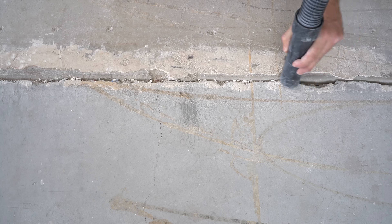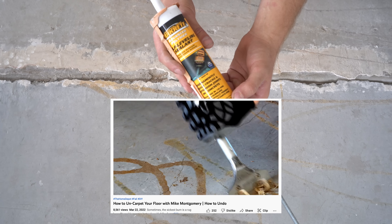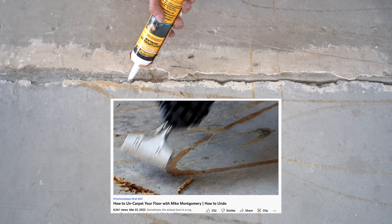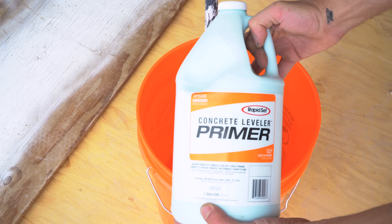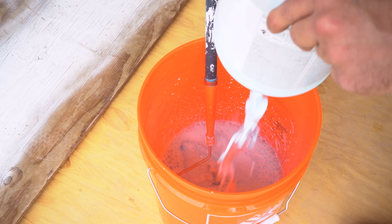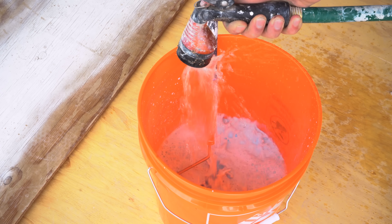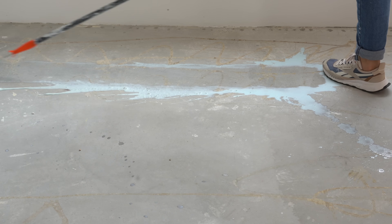A little while ago, I tore out my living room carpet — that was part of my Home Depot series, How to Undo, link down in the description. To prep my concrete subfloor, I used silicone self-leveling sealant in all of the cracks, and I applied two coats of concrete self-leveling primer. The first batch is mixed 50-50 with water, and the second coat is full strength.